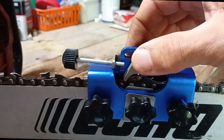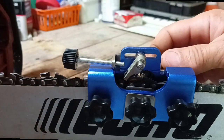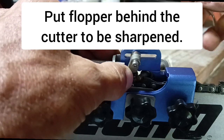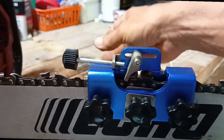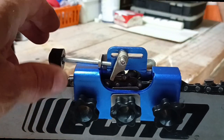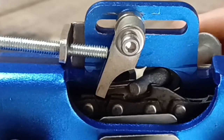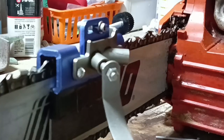I got this little flopper thing, and what this does is it pushes the chain against the file with a certain pressure in order for you to grind it. You set that up using the Allen key — you put the file in place, put the flopper behind it, and tighten that screw up a little bit. When you take out the file, the chain should advance when you pull it. Now I want to tighten this up to create enough tension so that when I spin the file around it actually grinds something off. That's pretty tight right there, and now when I spin this there's enough pressure that it grinds.